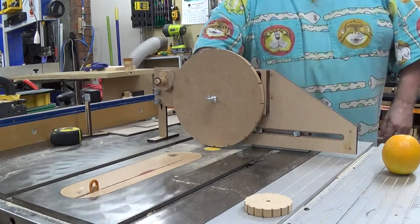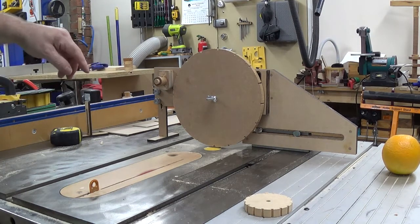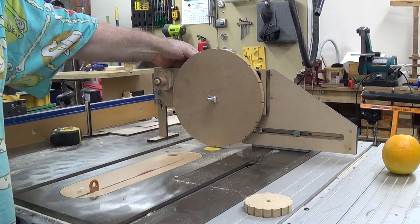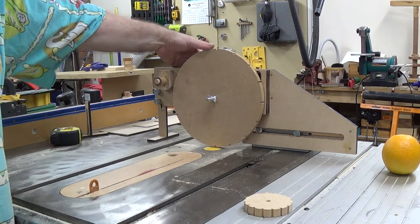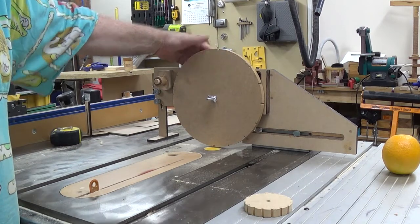Right. Now, one of the things you'll notice is that those are pretty big curves. I actually did move the table on the last one — that's why you'll find that it's bigger than what it should be. I actually moved it instead of keeping the pressure. As you can see, there is a little bit of play on it. What you always do is keep pressure in one direction or the other. This one I had the pressure on it, but this time I moved it back.